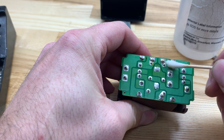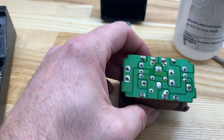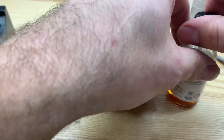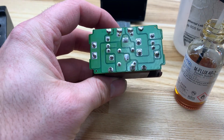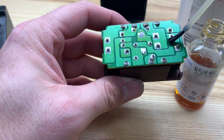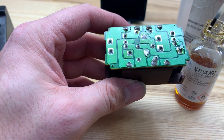I know this isn't anything special, but I'm an electrical engineering tech, so I'm kind of anal when it comes to my soldering and wiring. Alright, next step. After you clean it up, you're going to take some of your flux and very sparingly apply it to each one of your connections here.